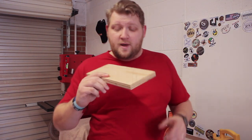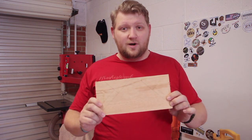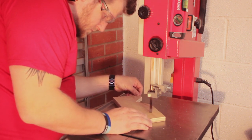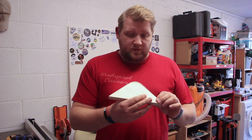I forgot to record it, but I made a little template for the box corners and started cutting it out. I cut it out and tacked some lips to the bottom for it to hook over the edge of the wood like a proper template — but that didn't work. The template I made was absolutely rubbish; when you put it on the corners it doesn't line up anywhere close to where I wanted. So I remade it, and this one followed the curve a lot better — I actually sanded this one's shape rather than tried to cut it, which was probably the key factor. Make sure your templates are right — templates are very important, I've learned.